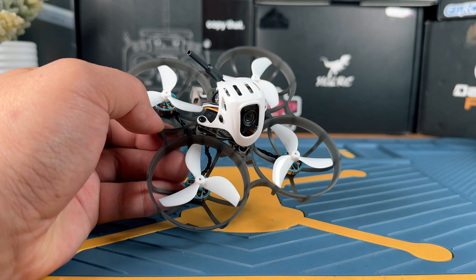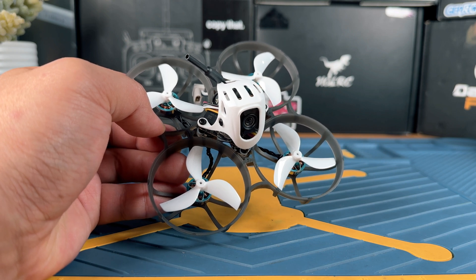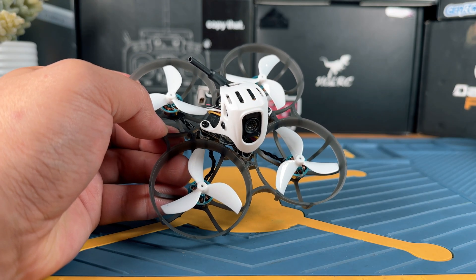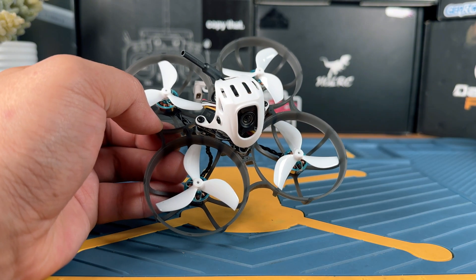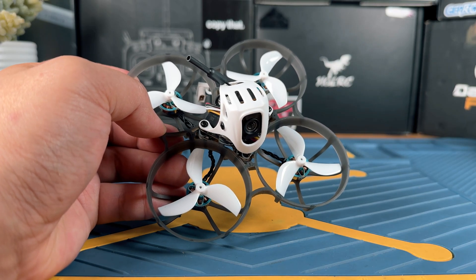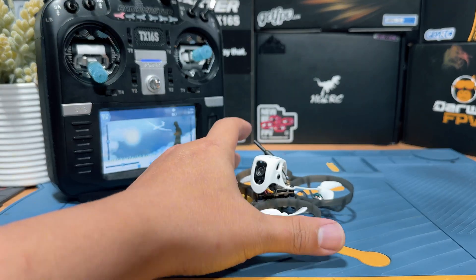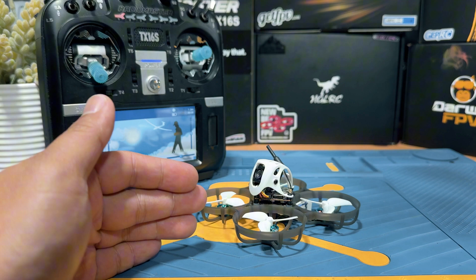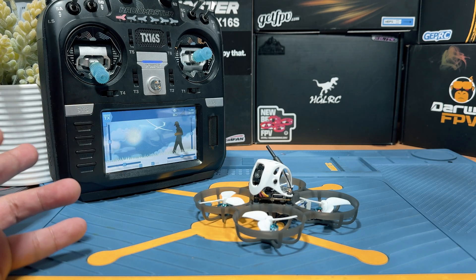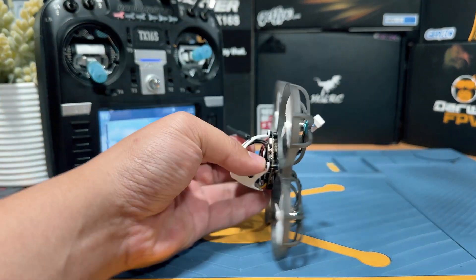The first option is that since this is an O4 air unit, you have a receiver built into the O4 air unit, which lets you use a DJI RC if you want. Obviously there are also some restrictions, and the video below will guide you through the entire process. The second option is you will be able to use ExpressLRS, which is probably going to be most of us. I'm going to guide you through the step-by-step process to set everything up in this video. Before moving to the PC for Betaflight setup, let's bind the drone with the radio first using the cheat method — plug the battery in three times to the drone, then activate the bind button on the radio and they will bind together. For the more advanced binding phrase method, videos are linked below as well.